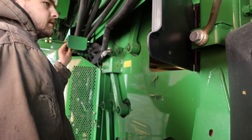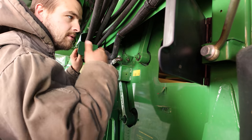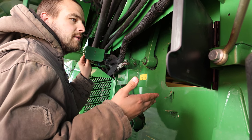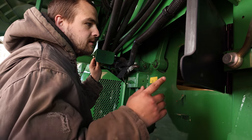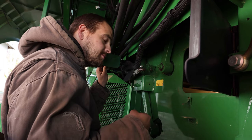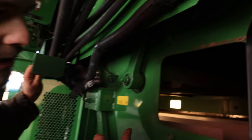You're standing in front of it. Oh, this one here. This is what you need to remember. The problem is there's a plate that goes down in front of this for when you're doing corn versus beans. And if you don't put that plate down when you go to corn, because the back end is spinning, it throws corn cobs back onto your chaffer and it bends them up.